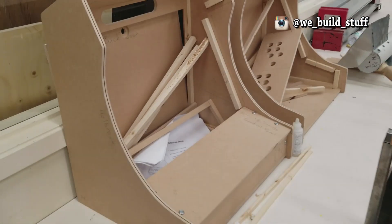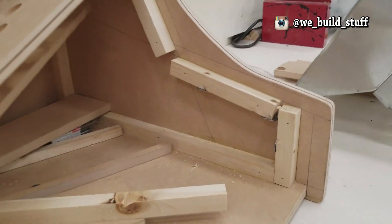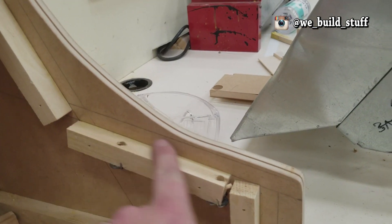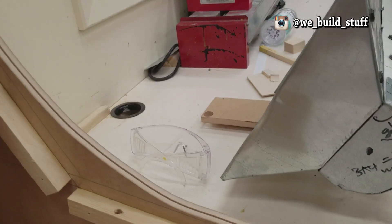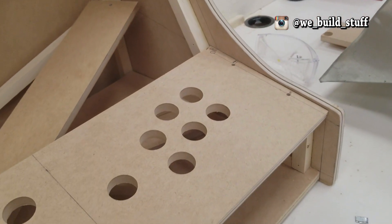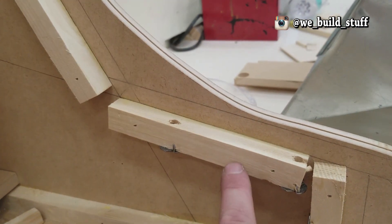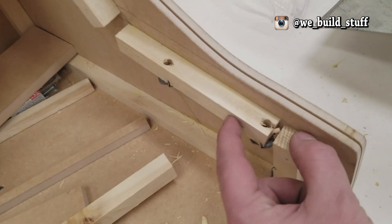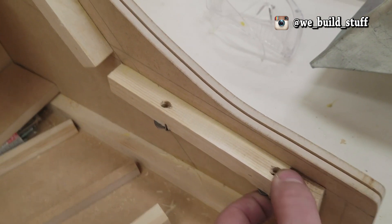You'll see on one of these ones here that's almost finished. By the end of this we should have our blocks mounted on here like in the drawing. We need to add all of our lines, leave a half-inch space for the material — in this case the control panel — and the block needs to support it. I'm choosing to do three-quarter-inch thick square blocks just because they're strong. This is pine so it can break if you're a little rough with it, but it works fine for this.